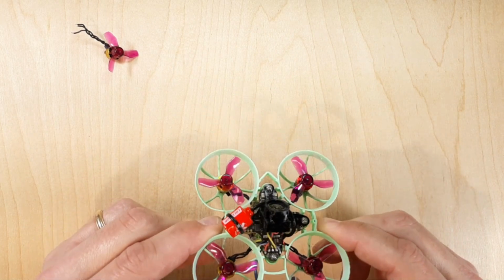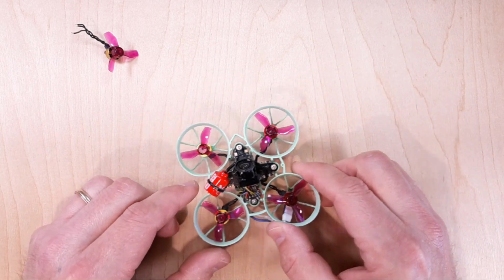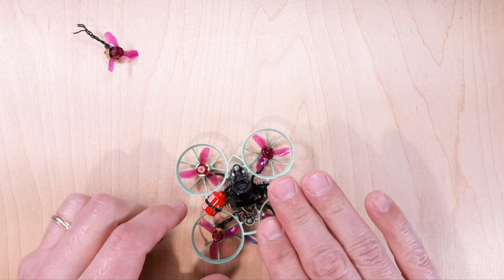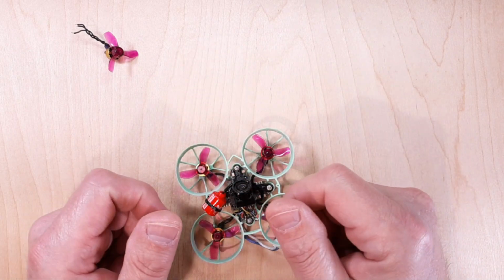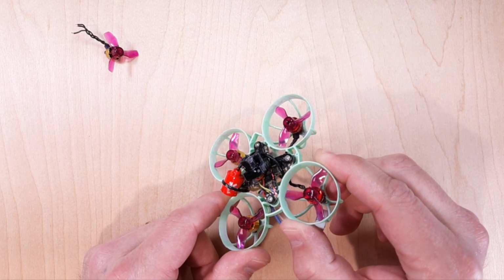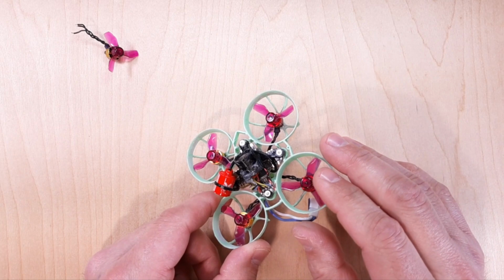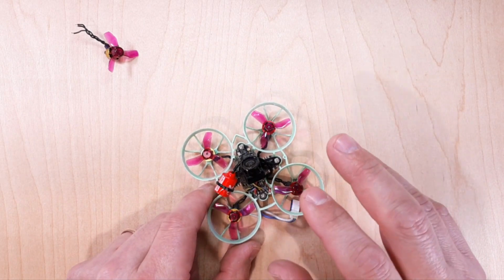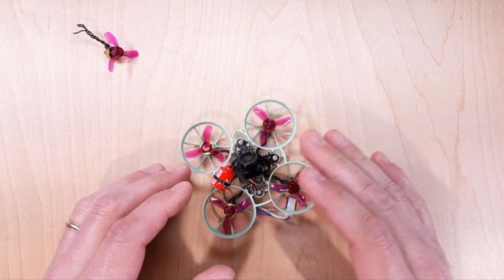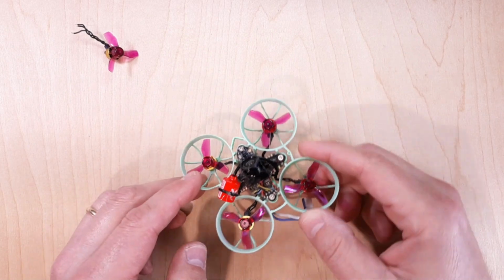And what will happen is as you're flying along, the quadcopter will want to lift. It'll become kind of floaty. It will want to slide out, so like when you roll into a corner, it'll want to kind of slide out. It doesn't want to stay locked in. It won't follow your stick movement. So your stick is saying, okay, I want 20 degrees of roll, and I want 20 degrees of pitch, and I want like a 5% track of yaw as I go around this orbit. It won't do it. If that shaft is bent, the oscillations and just the sheer anger of that vibration going into the flight controller, it's going to just mess with your PID loop so much that the quadcopter is going to want to either fly away, it becomes very floaty, it wants to slide out.